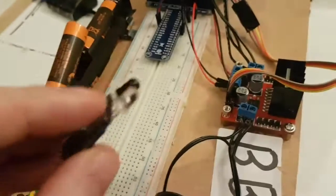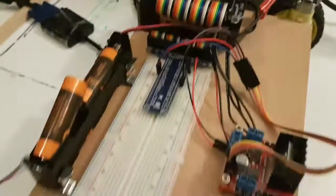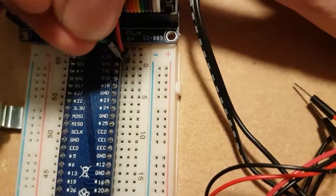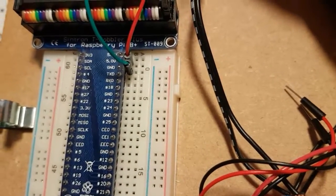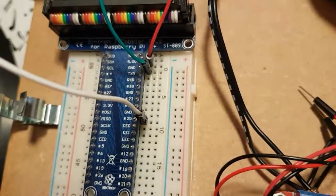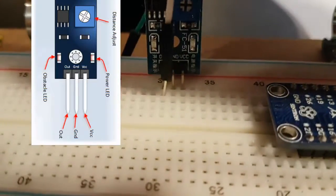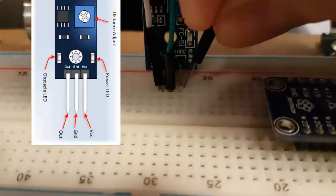We're going to attach this IR sensor to a Raspberry Pi. We've got a breadboard here, but you could just use jump leads straight from the pins if you wanted. I'm going to take a red wire and put it on the 5V pin, then a green wire for ground. A GPIO that I'm not using is GPIO 25. I plugged in all my other motors just to make this video clear. So there are my wires, and now I just hook these up to the breadboard — signal in first, ground in the middle, and positive on the VCC.